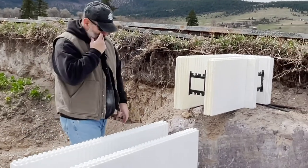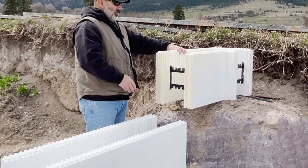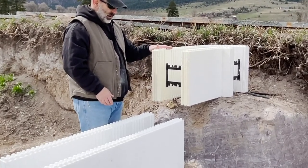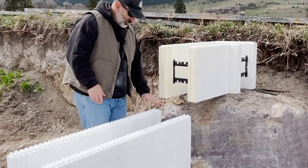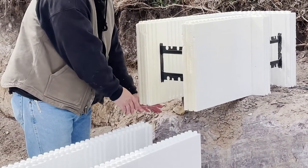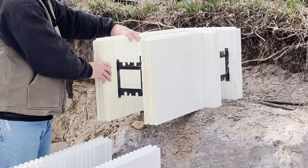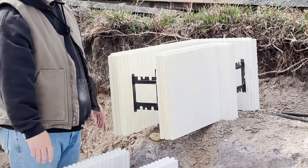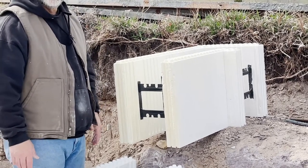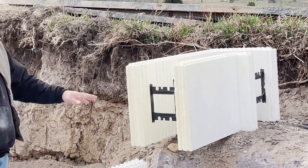All right, so the standard block's going to come up to here. This corner has to sit just like this. But we have the distance of the rock. So in order to make this work, when I put the corner on, I either have to find a piece to come up right here, be it plywood or using the foam to fill this gap to make it even, or I have to cut one of these down to where it's even with the foam. Either way, I've got to get this corner to line up so it'll be even at both corners across the top. So you're leveraging the rock for the height of the second. Well, I have to compensate for the rock in order to get the height that I want. Got it.